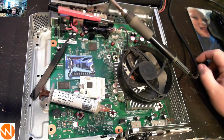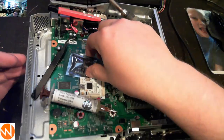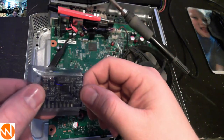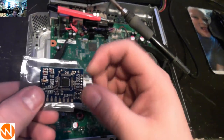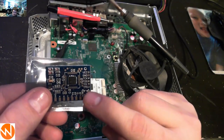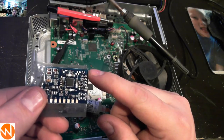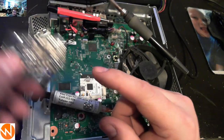Let's give you a quick overview of the tools and supplies we'll be using to perform this modification on this Trinity console today. The glitch chip we're going to use is a Matrix V1. This Matrix V1 does not have a crystal oscillator populated — with the Trinity console we'll use the onboard clock signal, so we don't need one.